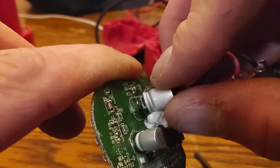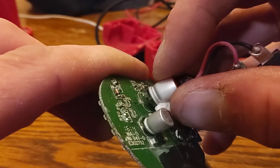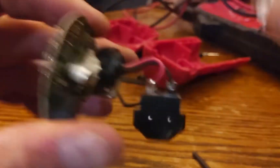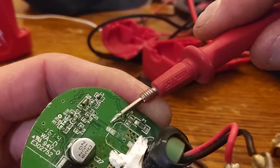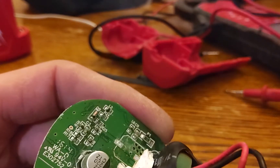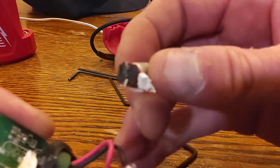I started picking at it with a pair of scissors, and look what we've got here. See that cap? It's not even soldered to the PCB — not even soldered. None. Zero solder. That's what this garbage is doing here. I just pulled it off. See those two contact pads? That's what those two pins are supposed to be touching. That's most likely why it didn't work — because it wasn't soldered.